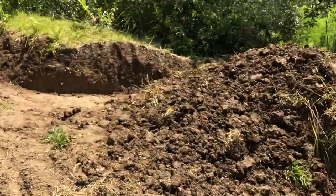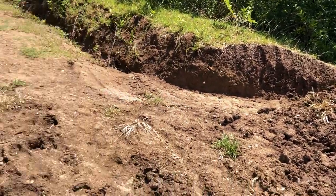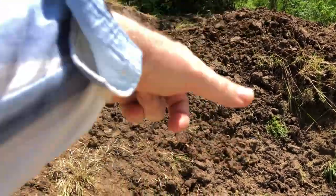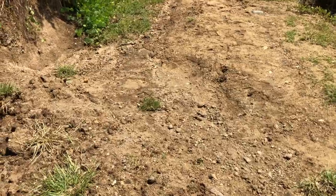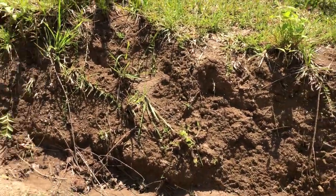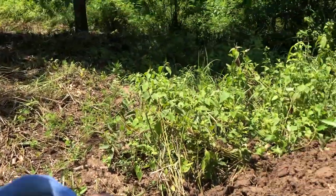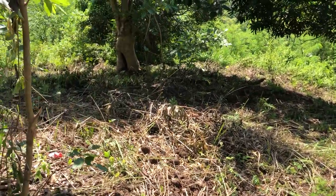And here's our other big one now. We've got a big pile of soil there — I'll get them to drop more of that down and make this a larger or deeper bump if you like. We've got about a meter there, two meters here. If we can get two, three, or maybe more of that soil and make this bigger — it doesn't really need to be higher, I think that's fine. We can scoop the drain out a bit more if we need to. But again, this one is capturing the water from this gutter and the other side. Nice and flat through here. And at the end of this the water is just flowing down there and into the gully, but it's not going to hurt anything. And if I can harness this later with a swale here, I will.